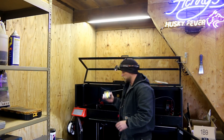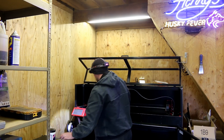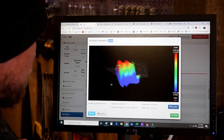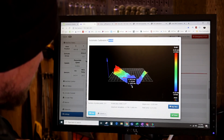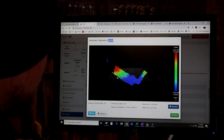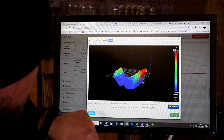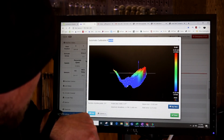We're going to run the tilt calibration again and then the bed leveling again, and hopefully we get a better result. Here's the dip right here - the lowest on this side is 0.557, which according to when they did theirs they were at 0.55 as an offset, so let's assume that's fine. Here is where we have it tilted a little bit - see that big line coming down there? That's where we have a sharp drop off. Look at that! What could possibly give us that sharp of a drop off? That is our big question.